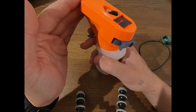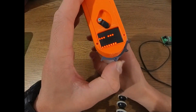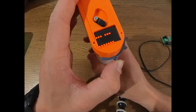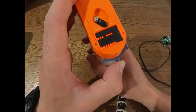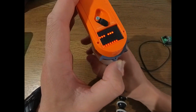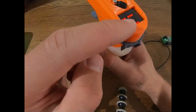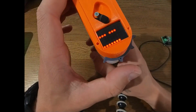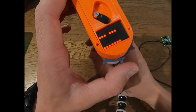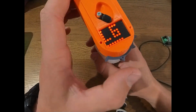Now, one important thing: if we give it throttle and we steer, steering will also elongate this 5-second timer. So you can see I can steer basically infinitely long. It will not go back. I actually need to let go of both the trigger as well as the steering, wait 5 seconds, and then I am back in the gear switching mode.